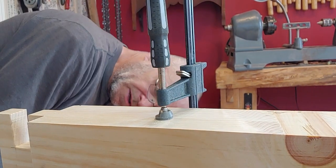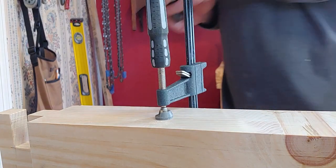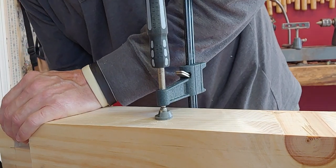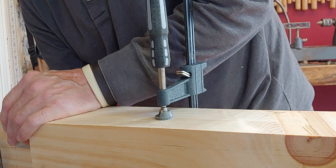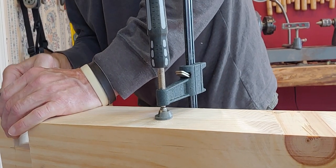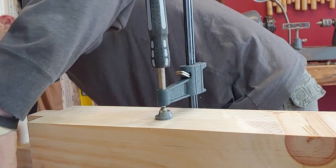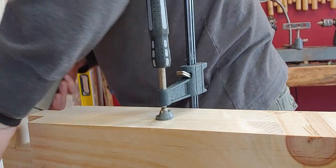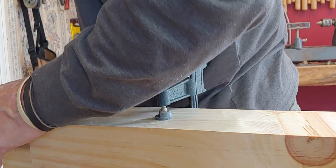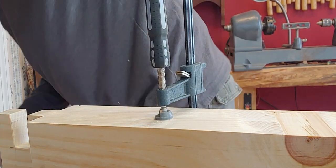Okay, it looks good. On those I made sure I cut the line rather than inside the line, so I gave myself just a tiny bit of extra room. Chamfer the back side so we don't blow it out. Make sure it looks even. No sense at this point in the project trying to do something too fast. Just less and even is better.